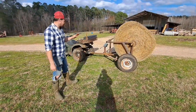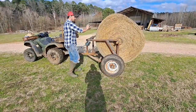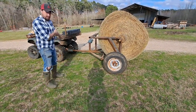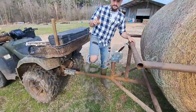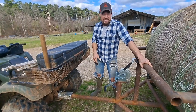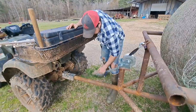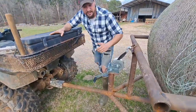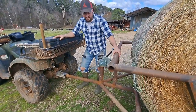Because of the way this sits back like I talked about, it takes the weight of the bale once it's on here and puts just enough pressure back that way that the trailer is still balanced — so there's not a huge amount of weight on this tongue. So I can unhook this. I will say this: come over here and do this beforehand. I'm not saying this is safe, and I'm not suggesting you do this on anything — I'm just telling you what I'm about to do. Make sure you feel it and make sure it's not pushing upward. If it's pushing upward and you go taking that loose, it can hit you in the face. If it's pushing downward, it's got the weight pushing down on your tongue.